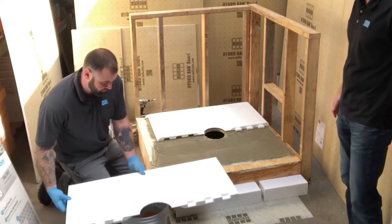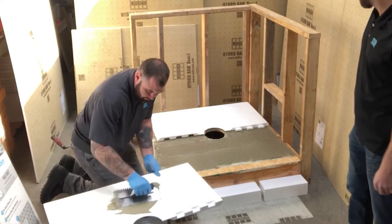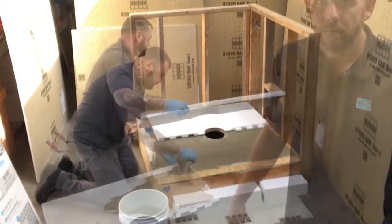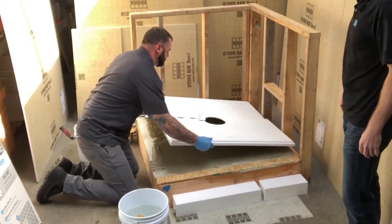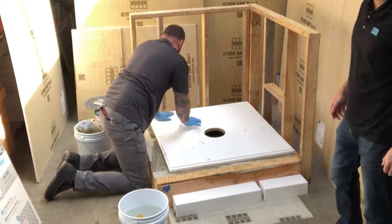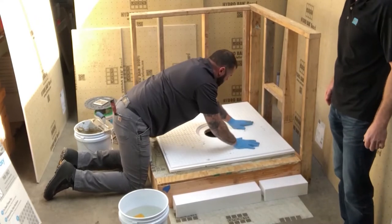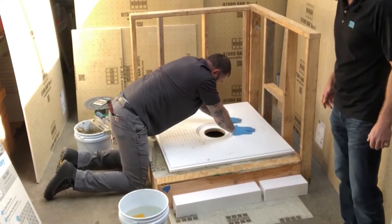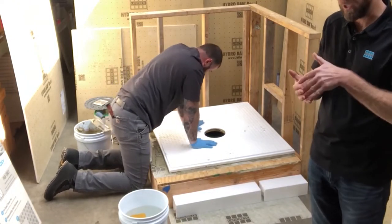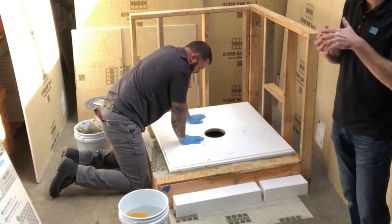Okay, flop the pan in here. Again, two-piece interlocking. All right, at this point, we're just gonna drop a level on it, make sure we're good to go. Pan is in, rough to rough. You'll notice the perimeter of the pan has a half-inch rabbet cut into it. That's to accept half-inch wallboard. Curbs also have a half-inch rabbet, so it locks together very nice.